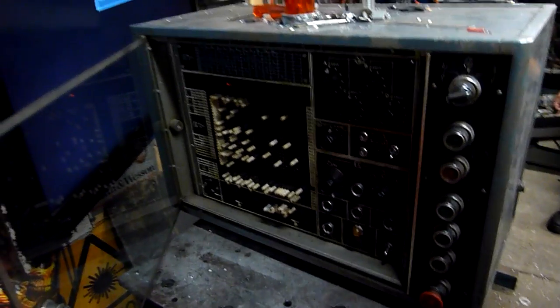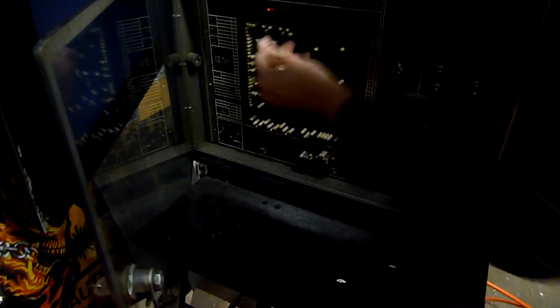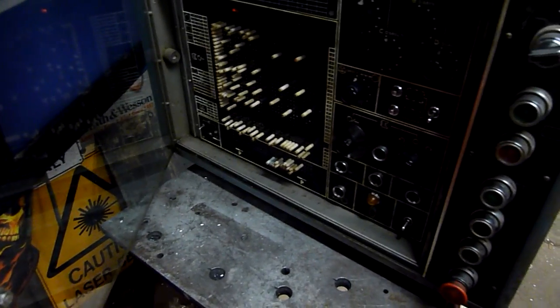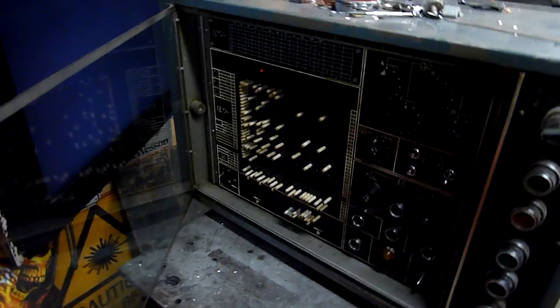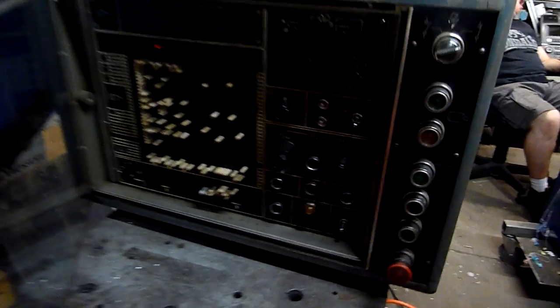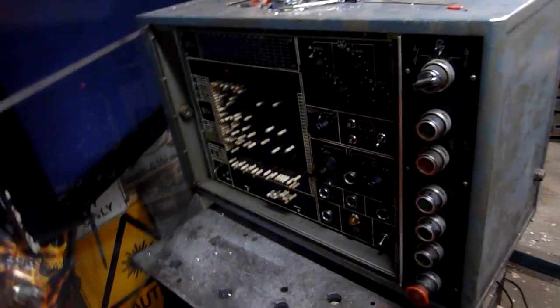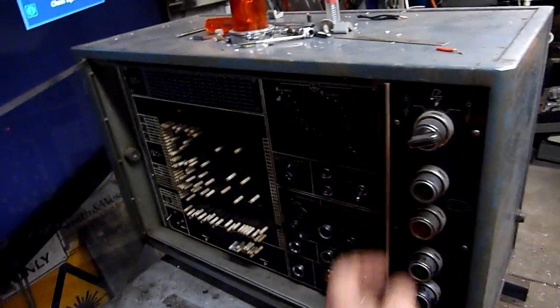Pretty cool stuff for its age — something made in 1960 or 1970. Open and close the jaws. This machine didn't actually have a chuck; it had a collet hydraulic drawbar, so it was made to be fed with a bar feeder and just continuously fed with solid bar stock. No chuck, no human interaction between parts — it just does it all itself. These accessory buttons — 23, 24, 25 — are custom and triggerable here for things like the bar feeder. There was a sticker but it's fallen off. You could put custom accessories in the program.